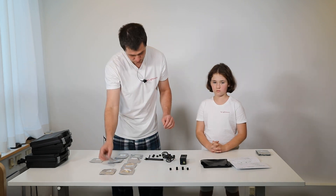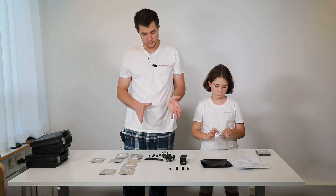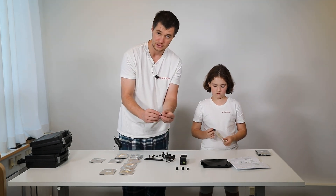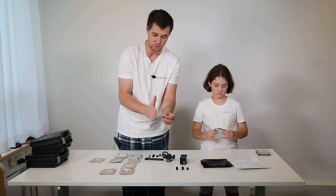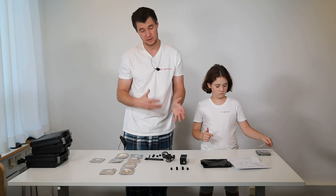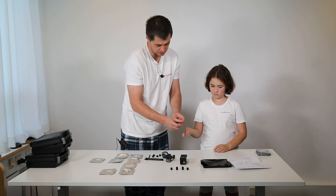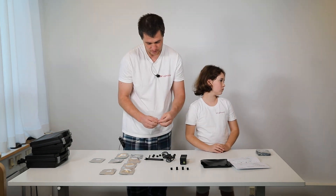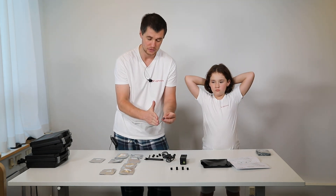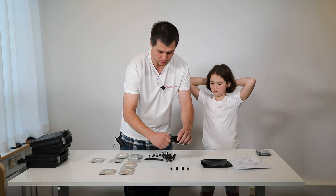Another probe would also be contact but with deeper penetration. This one was designed to measure samples where the laser spot is approximately on the surface of the probe, but it will also penetrate because of confocality and numerical aperture up to 20 microns in depth. This probe is designed in a way that it will actually not measure the contact material but will focus a little bit in depth — 40 to 60 microns. But it looks very similar.